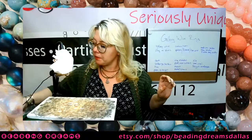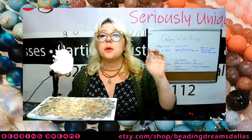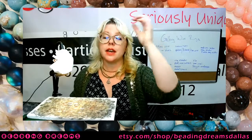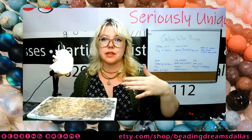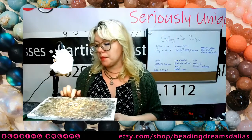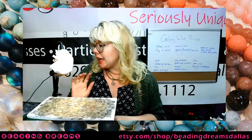Yes. Thank you. So always start with the highest density solder, all right? If you're using medium, easy, extra easy, you always start with the highest, which is in this case medium, then you step down. So I'm doing my band with medium.